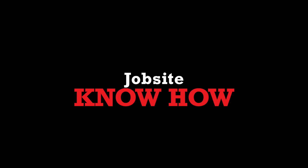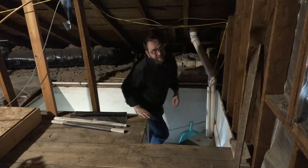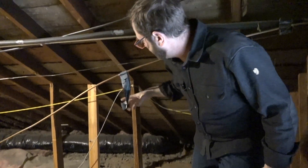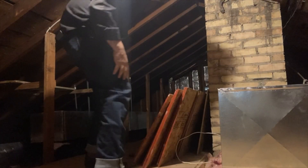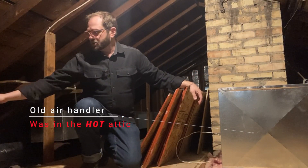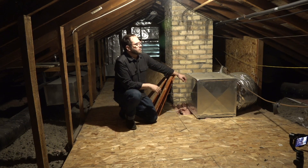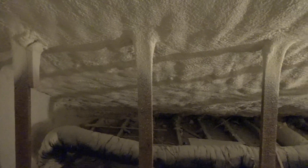We're going to jump into the Wayback Machine and look at the before scenario for this attic. We climbed up there in late June and it was warm. We've got our refrigerant line just dangling here — looks like someone tried to use duct tape to hold it together. And we've got our air handler up in this hot attic. Insulation on the floor is kind of iffy, with some mouse droppings. We're going to change this whole condition — we're going to put our spray foam on the roof line and bring all the ductwork and mechanicals inside the conditioned space.